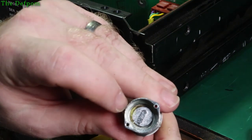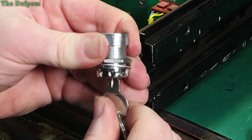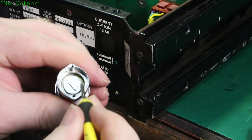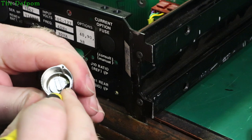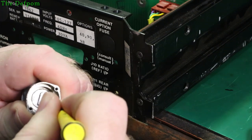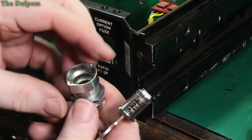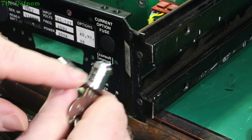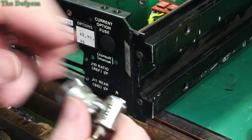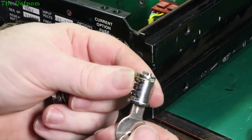The disc goes through and pops into the back there. All you've got to do is leave that disc out of the way and have something in the barrel. This key won't work on this one - it doesn't suit it. You just pop that disc out of the way and then slide the barrel out - that's what's retaining it. Some locks actually have a disc like this somewhere else, not on the back of the barrel. Sometimes you can stick a pick in and lever it to pull the whole barrel out without even having the key, but that's usually only with very cheap rubbishy locks.